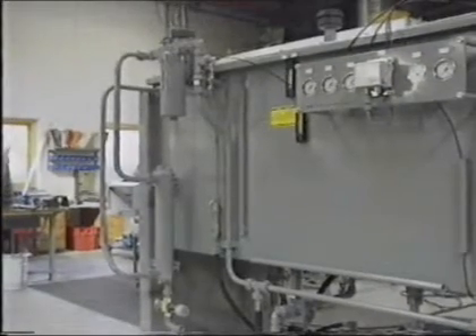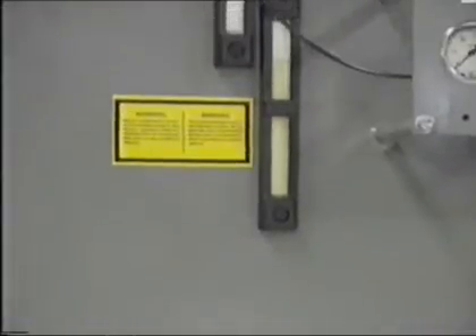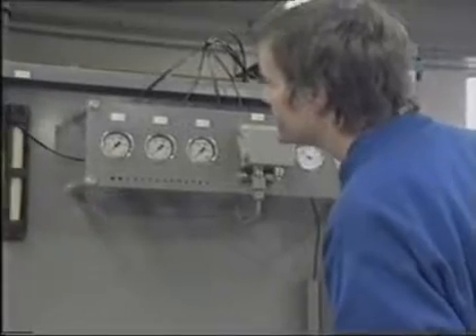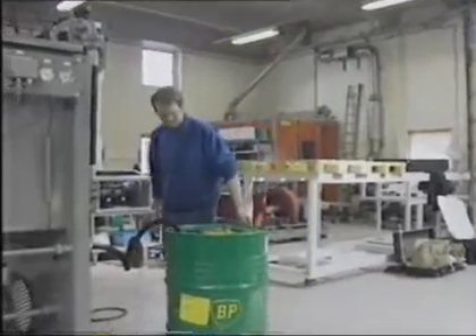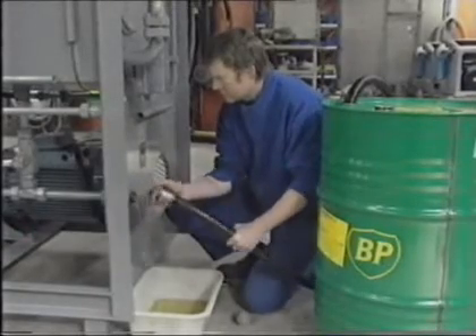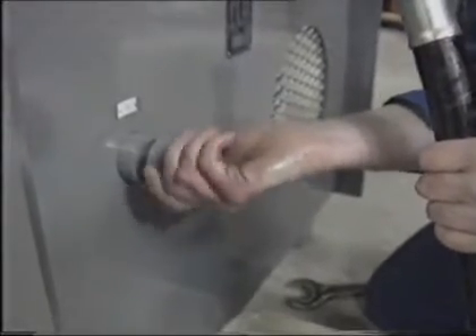When the drum is nearly empty, the electric motor is switched off. The motor is restarted and care must be taken that excess air is not sucked into the system. The process is repeated using a new drum of oil. Six drums should be enough to fill the system. The level in the tank must be checked continually. Filling up to level one is carried out in connection with the very first equipment start, or when oil has been drained from the system. This is necessary because the cylinders have to be filled up with hydraulic oil. When level two is reached, the hose is removed. The cap is remounted and valve 20 is reopened.